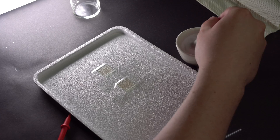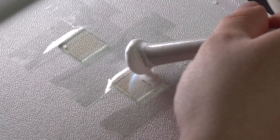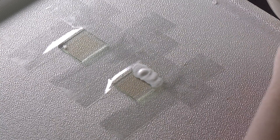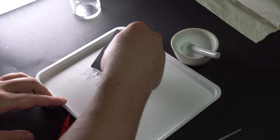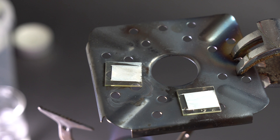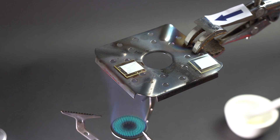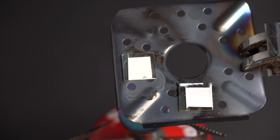On the next day I made two more glass pieces coated in titanium dioxide. This time I made the paste more liquid and also added liquid soap to it in order to better wet the glass. I was heating the glass for 30 minutes at about 500 degrees Celsius.